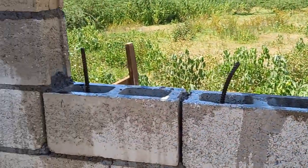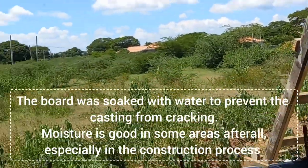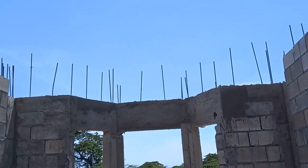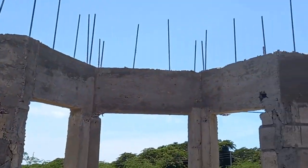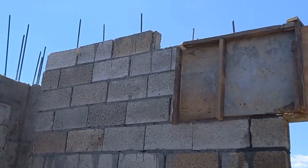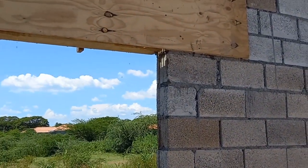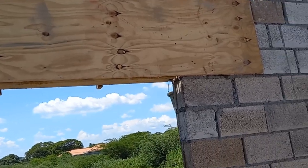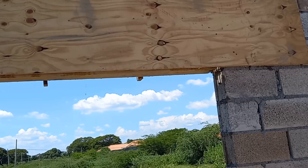Look closely — you'll notice water is dripping from the platform. You'll also notice that the blocks in this vicinity are soaking wet. That's because the builder poured water on the ply and in the form prior to throwing the concrete mixture in. That helps to prevent cracking — the same thing when the foundation was being cast. We mentioned watering the foundation, so the plies must also be watered when you're casting the lintel. Zooming in a little closer, you'll notice that the ply form extends beyond the width of just the window opening.